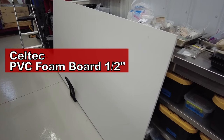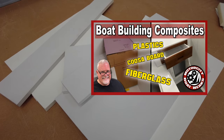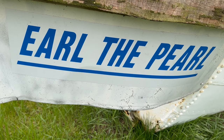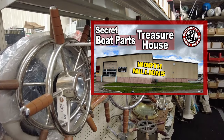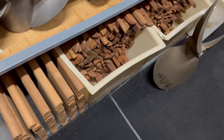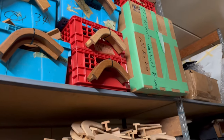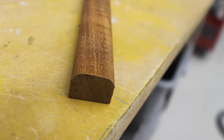There would be times when the table needed to be put away and not even present in the cockpit. I wanted to make something nautical and a little bit decorative, perhaps with a nautical chart and some teak trim. I'm always trying to keep things light, waterproof, and easy for maintenance, so I decided to make the table out of half-inch PVC foam board — basically a rigid plastic. None of my boat restorations would be complete without some parts from Earl the Pearl. Hidden in one of the corners of his 14,000 square foot shop, I was able to find some round teak trim and teak board stock I could route down and use for the cockpit table.